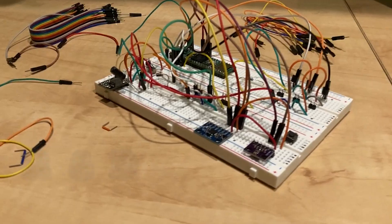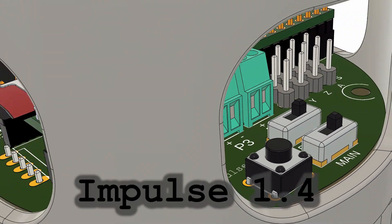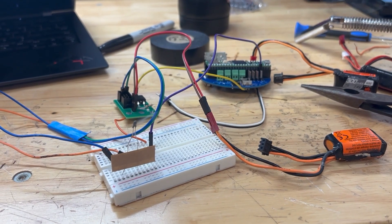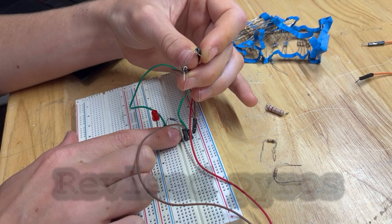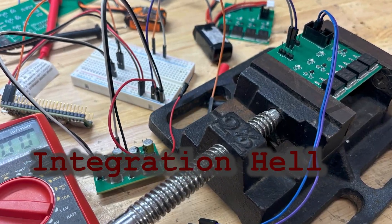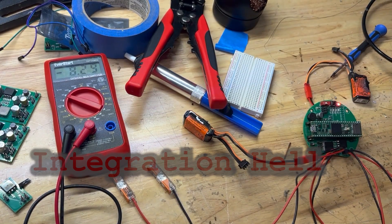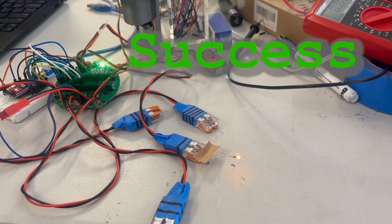This is the electronics bay, where I store my electronics. For this, I had to do prototyping, PCB design, and finally I had Impulse 1.4 — my first design for a printed circuit board on this rocket. These are the pyros for igniting the motors, but they didn't work at all. So after lots of testing, I integrated it all into a PCB — this part of the process really sucked, it took like two weeks. But finally I had Impulse 2.1, and the pyros worked really well.